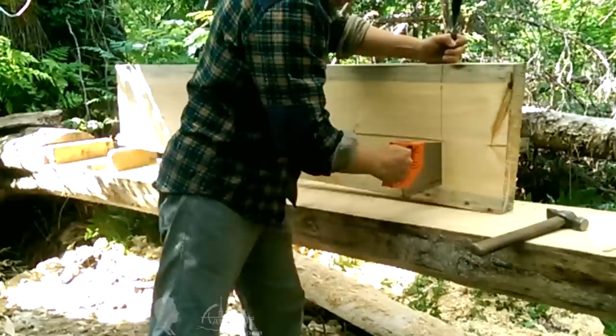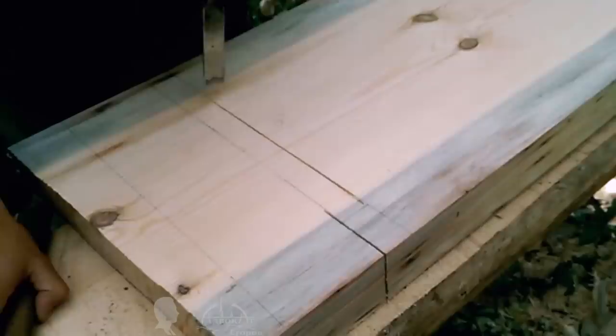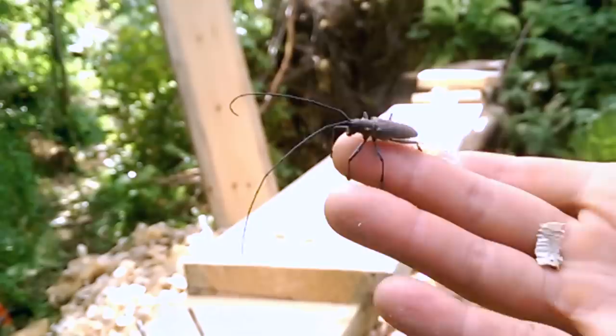I made a couple of precise cuts and carefully shaped the round tenon. The slab got noticeably lighter. There will be 2 tenons on the door, so I shaped the second tenon in the same way. The second board just needed to be cut to size to tightly fit the doorway, that was installed into the cabin 2 years ago.